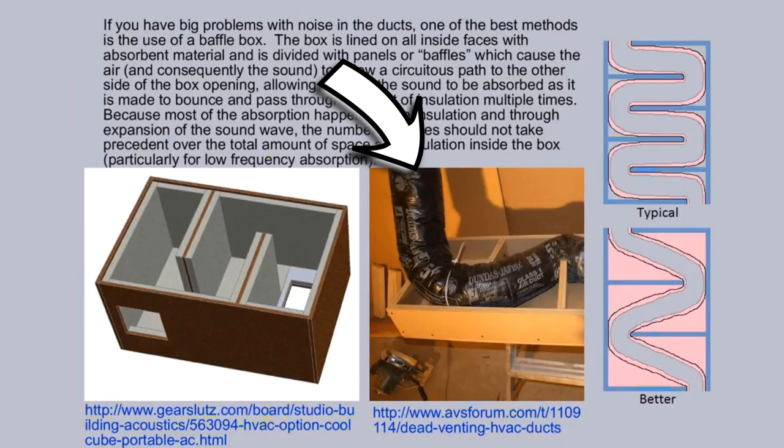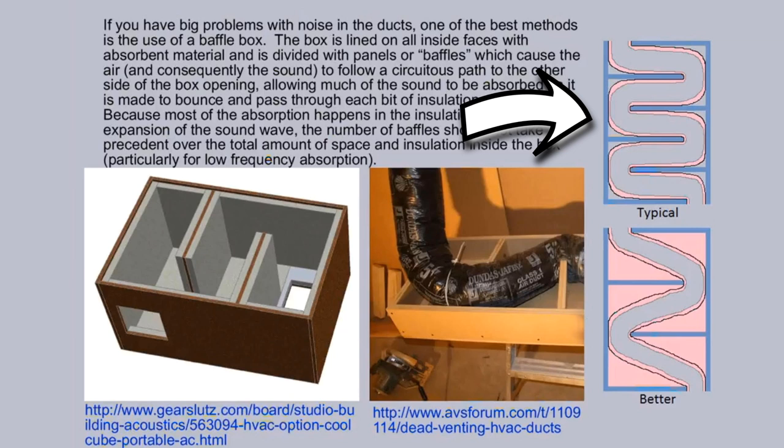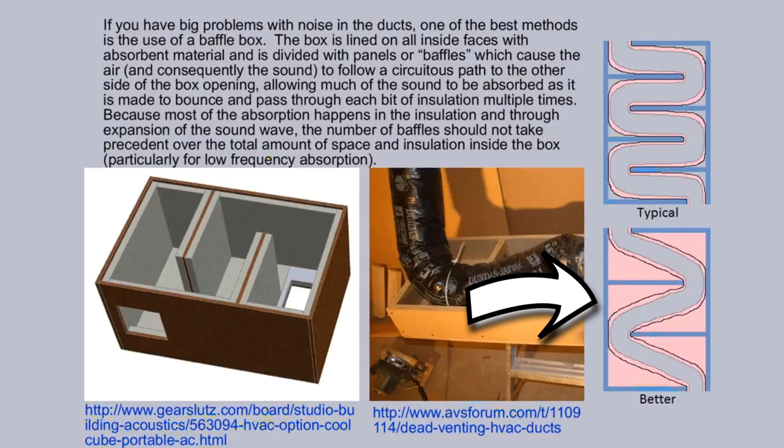When you put your hand over the vent after the unit was on, you could barely feel the air coming out — it really slows down the airflow quite a bit. The image more in the middle is the way I'm going to be building these baffle boxes, which is essentially just flexible ductwork inside of a very heavy-duty thick wooden box. All the way to the right you can see two ways to do that — the typical one is like a big labyrinth of 90s and turns, but below that is the better design I'm building today. It has fewer 90s and sharp corners, and mainly you can pack more fiberglass insulation inside the box to help absorb more sound, especially the low end.